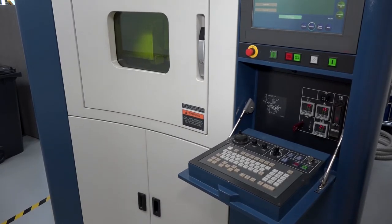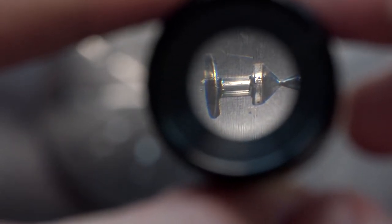The subtractive capability provides multiple benefits at once. For example, channels and cavities in parts — you can now build them up and then machine them for better surface finish and flow quality. We've done test projects with the MTC specifically on machining channels. Where typically a part would have linear holes drilled and plugged, we've managed a six-into-one completely machined enclosed part. It's stronger and achieves about 90% weight reduction, which is a huge benefit for aerospace companies.